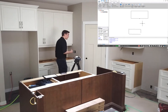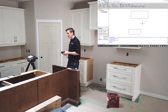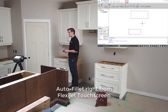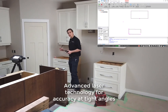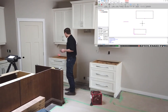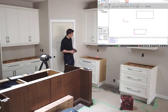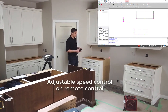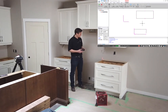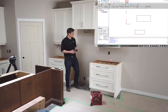While I'm at it I'm going to capture the rest of the geometry of this room, and I'll show you how measuring works with the remote control — I can just pick it up and keep going. It's very responsive to the FlexiJet. I'll grab the scribe function and work my way down this side wall. Even though my laser spreads out in an oblong shape, I'm going to get accurate measurements by using that advanced laser technology to actually measure the wall multiple times each time I press the button. You can control the speed of the laser with different velocities on the different pads — faster speed on one pad, or super accurate fine controls for dialing it in.